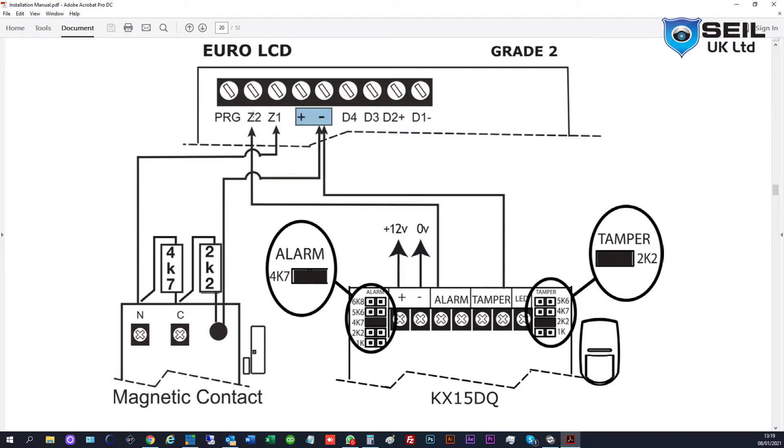This negative and positive give power for the PIR - this cable going here. And this is for zone Z1 and Z2, as you can see here - this is showing the door contact. You can use a resistor or you can use a built-in resistor. For the PIR I use a built-in resistor. I left a link in the description - this is the easy way, just cut the jumper only.